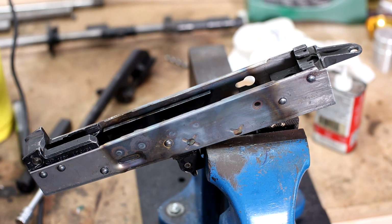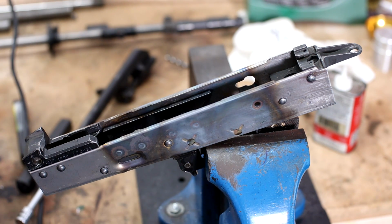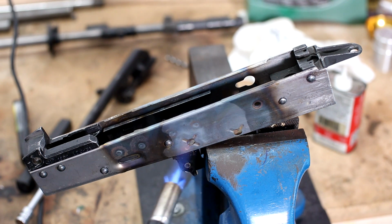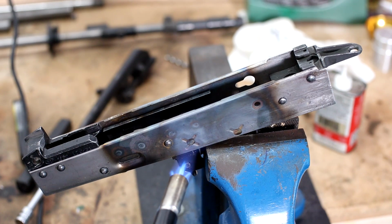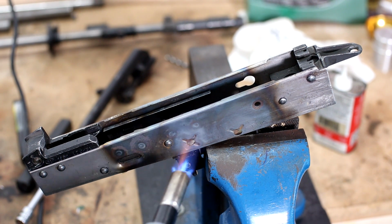Sorry about that, camera died. So, we got this heated cherry red and then quenched. So, last thing we need to do is bring this back to a dull gray on all four without quenching, then let it cool down naturally, and we're done with the heat treat. We'll start building it back together, so let's work on that. That is not a dull gray, that's the water drying off. So I'll show you when we hit a dull gray. You'll see it set in.